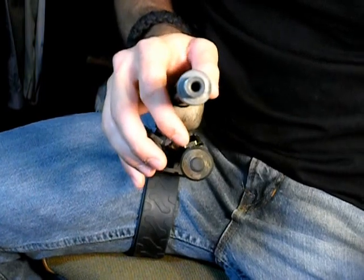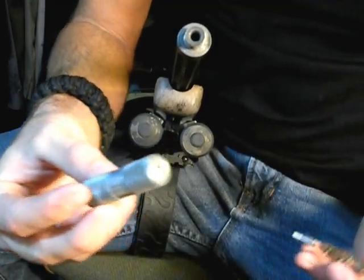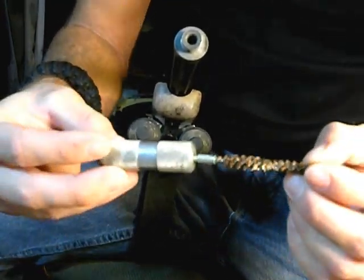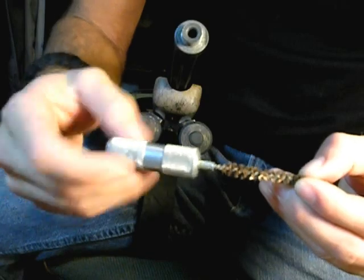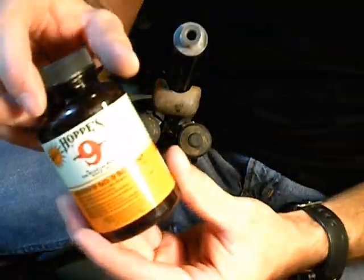because it's going to scare you how much can come off of it. Now, first thing you want to know is a trick for holding this wire brush that doesn't tear your hand up: use your little primer holding tool. The threads are exactly the same, so give her a quick thread on there, and now you've got a handle on your brush.